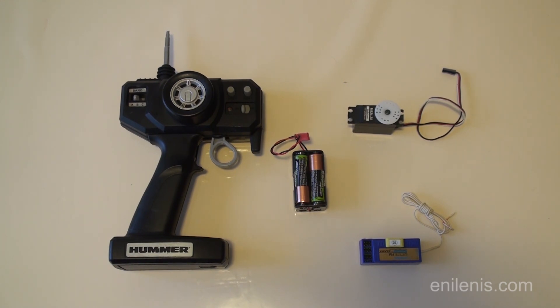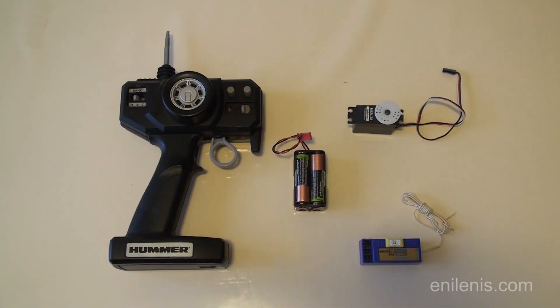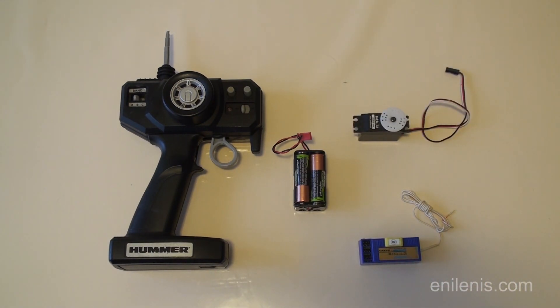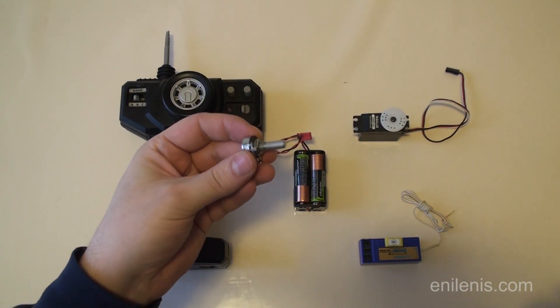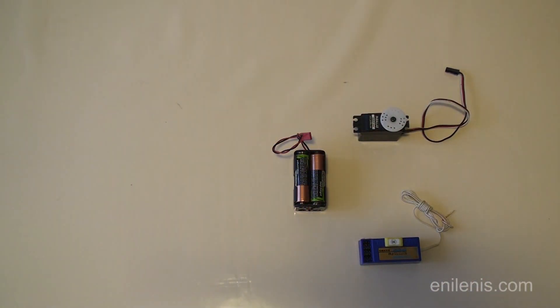You can use a variety of RC kits — most of them will work regardless of the brand. What you will find in the standard kit is a transmitter, battery pack, a receiver and a bunch of servos. What we will do is replace the main potentiometer inside the transmitter with a custom one. In this case, I used a 5K linear adjustable potentiometer with a knob and ended up with something like this.